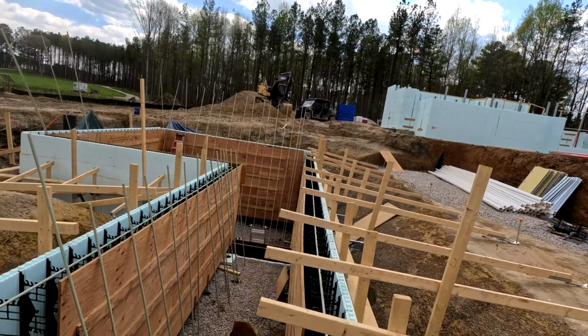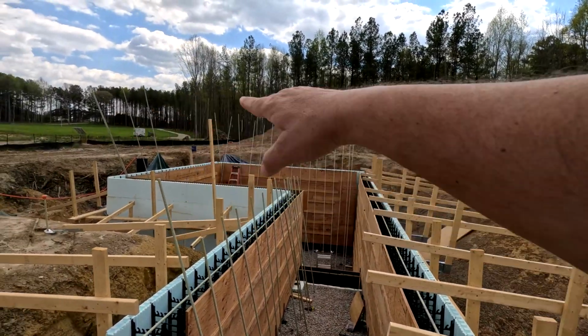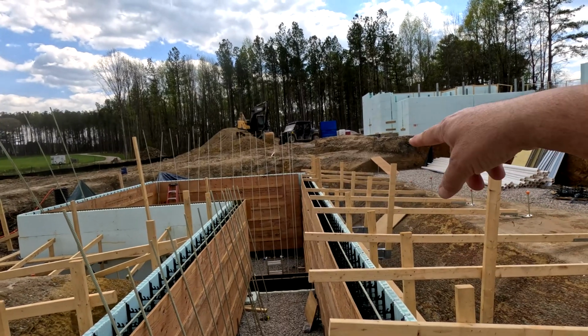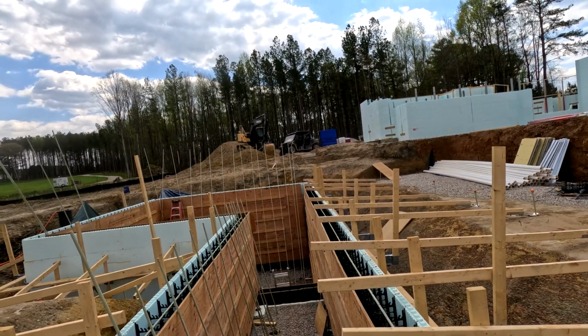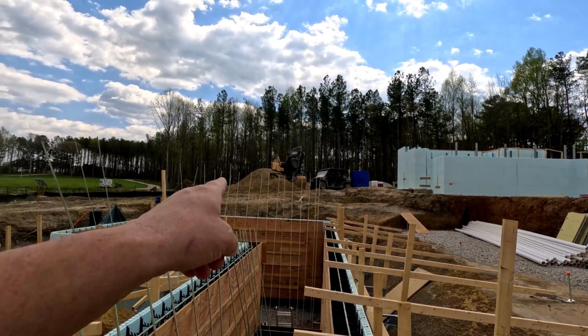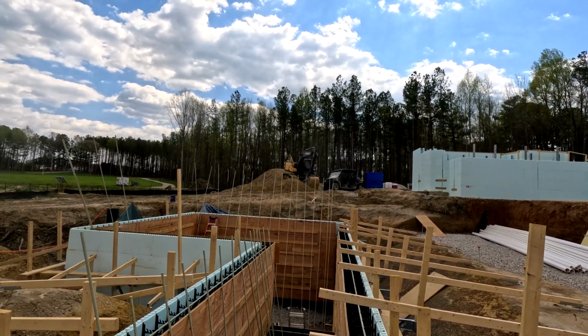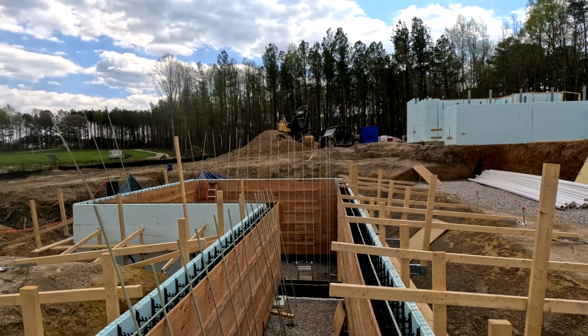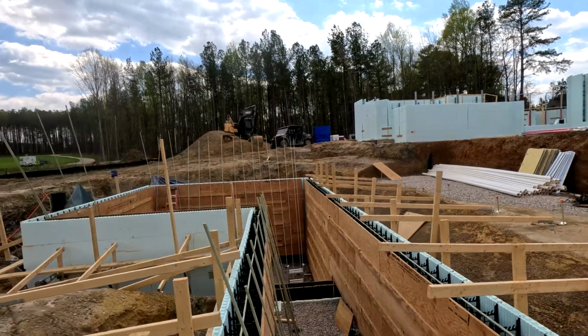We'll see as I stack through here, because those are all getting cut down because coping goes on there and it's done. But this one, the wall continues, so I want to keep rebar sticking up about as high as you see those right now. It's going to be a little more difficult to set the forms on this wall, but it'll make for a stronger wall, and I'd rather just do that.